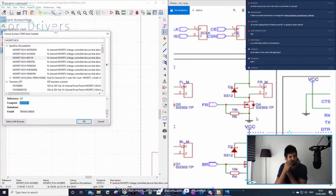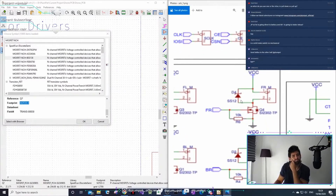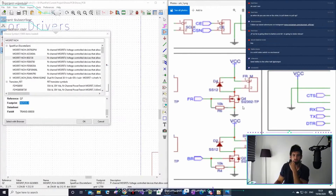That's more at the logic level. So if I put a one in, I'm actually getting a zero on the output - I pull this part low, which is zero, and the motor will go on because the circuit is closed. Most of the time we use N-channel MOSFETs. If you use a P-channel MOSFET, you're inverting your logic.